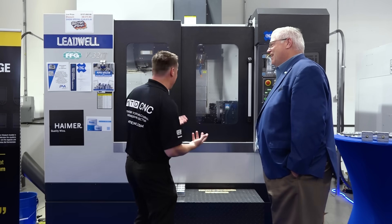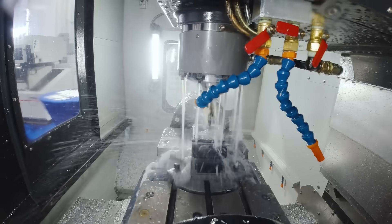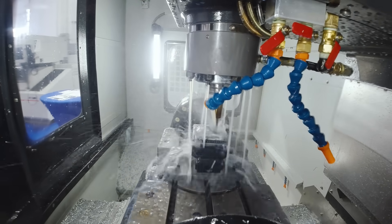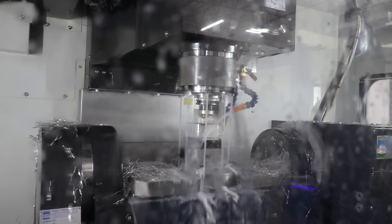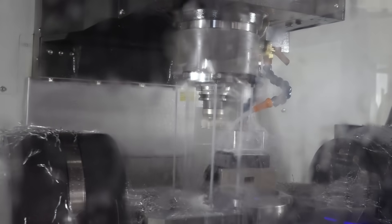I have a little bit of a cheat code — before we hit record I asked a few questions, so I don't just look like I'm making things up. If we look inside this machine, there is a centerpiece that spins in a circle. But it looks like if I was to bolt to the outside, that removes my opportunity to spin in that circle. But you've told me those pieces can get removed if I need a bigger workpiece to go in there. That's right — you've got 33 inches of clearance between the two axes of the trunnion, so you've got that much diameter to work with. The two side plates come off, they're removable, you can mount a fixture plate or mount a part directly to that with a larger diameter. With those two side plates removed, you have the clearance to rotate that part and do additional larger workpieces.